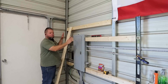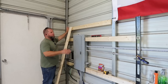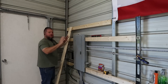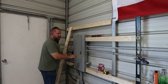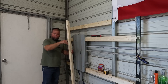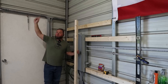I have a wall that I can't actually frame out due to all the electrical here, because back in the day I never intended to do a solar room — had no idea this was coming. So I'm spacing out some blocking on some horizontal two-by-two steel that I have back here, spacing out to the point that eventually I can put some sheathing here. In this particular wall I want to make a big section of sheathing removable so I can access knockouts for future wire pulls and runs. I don't want to do a vertical stud wall here and block my access to my panel. The walls running this way will give me vertical support for a load overhead, plus a big two-by-eight that I'm going to lag into these steel studs right here.